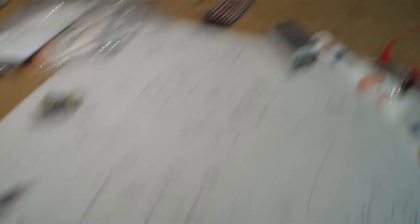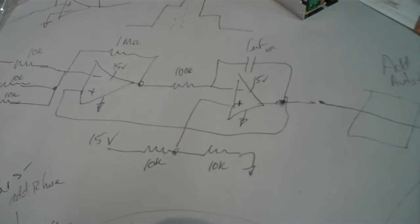There's going to be a circuit that my friend Mark came up with that takes those voltages. When there's a change from one voltage to the next, it's going to make that change over a little bit of time — more of a ramping function. The reason for that is you can't change stepper motor speeds instantaneously, so in the analog world it's going to do an acceleration and a deceleration.